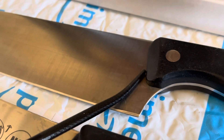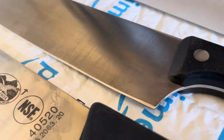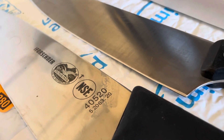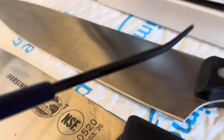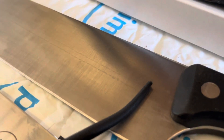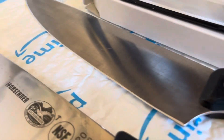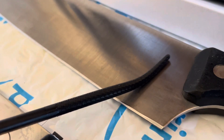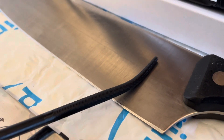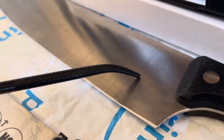You start at the higher hardness file to prevent wearing down your files. You're supposed to use this curved spot and not bite an edge — you want a smooth surface. And yeah, it's biting readily. I don't want to scuff up my knives, so let's go down to the 60. And that's biting too. Same result at 55 — I'm bumping another knife with the handle. Well, that's impressive that this Chicago Cutlery is this hard.